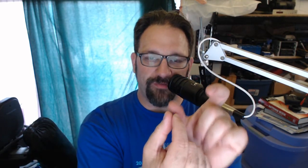But it was an easy way of doing this instead of getting one of those little blue modules that they make for RC car chargers and whatnot. But you'll notice, because the common and the current meter, the common is the negative side for the voltage meter. So to use that common for current, you also have to measure the negative side of current. Here's the problem that I ran into.